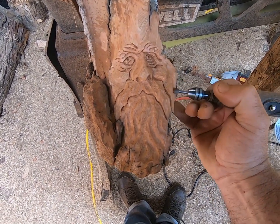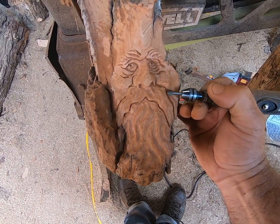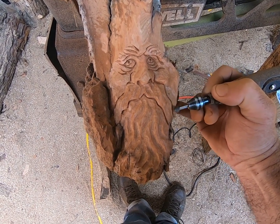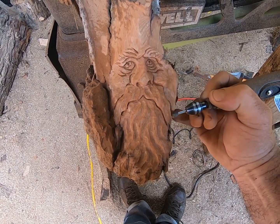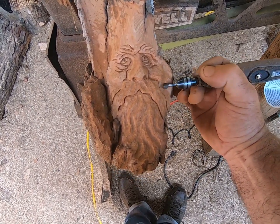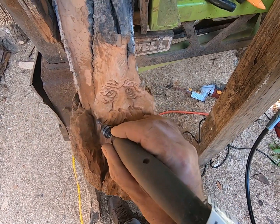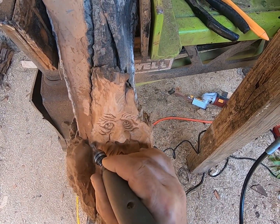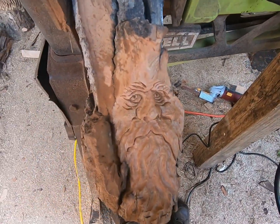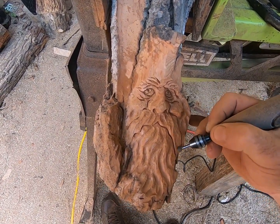Add some hand tools and put some V-cuts in there with a V-tool after you use your power bits. You know, sand it down, leave certain parts rough. Go behind the carving and around the sides to really get a good effect when you're doing hair, especially. Okay, those are just little tips that I found really helped me out, and I started doing through the years. And that's pretty much what we're going to do, though, is start practicing a lot more wood spirits, maybe do another walking stick with hand tools too.